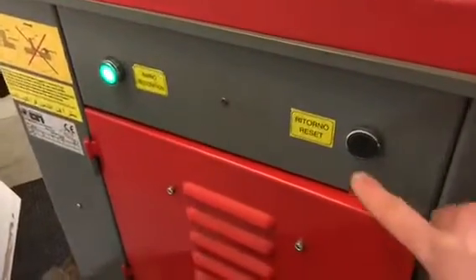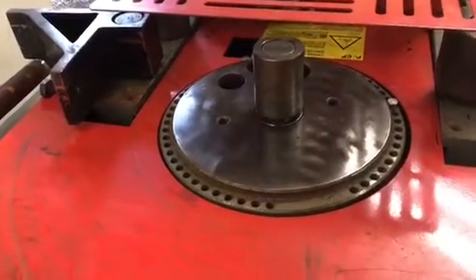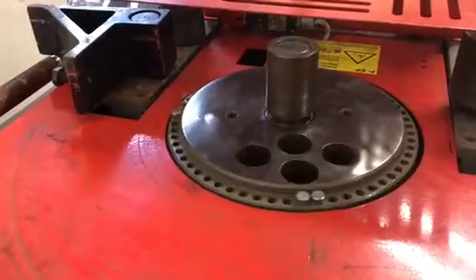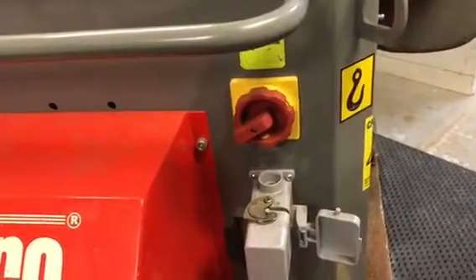The machine has been plugged back in and turned on, so push the reset button. This button here is to return to zero — if you stop the machine and it's not at its home or reference position, you can push this button and the turntable will rotate and reference back to its position. The machine is set to rotate in a clockwise rotation — we'll just check it now to make sure that it is rotating clockwise.